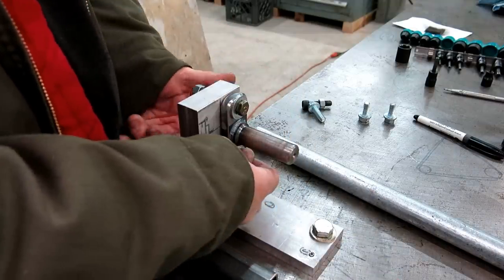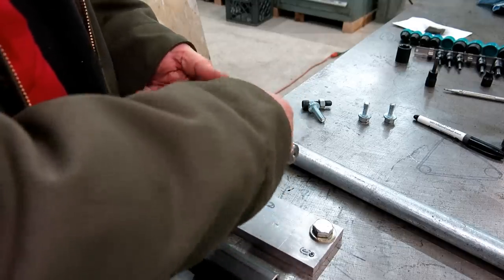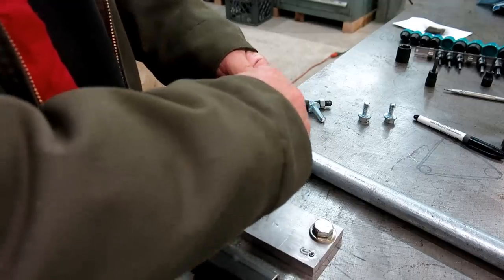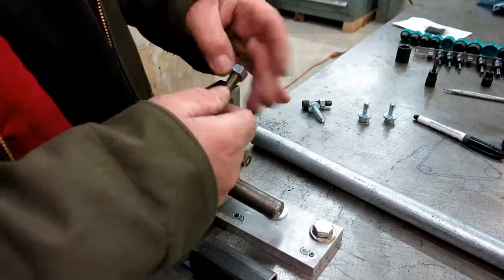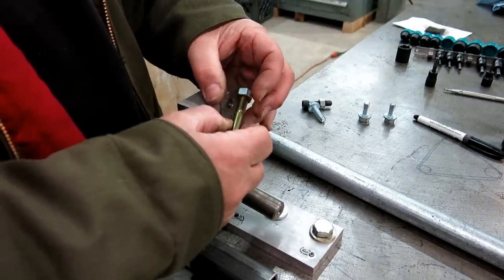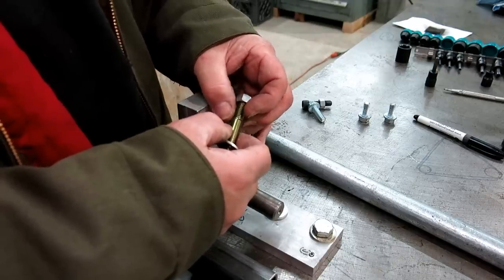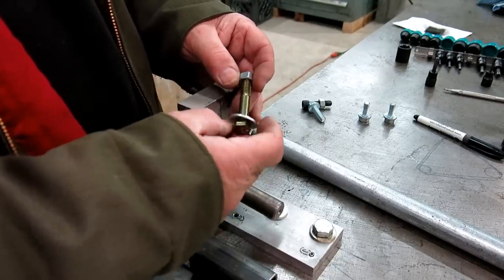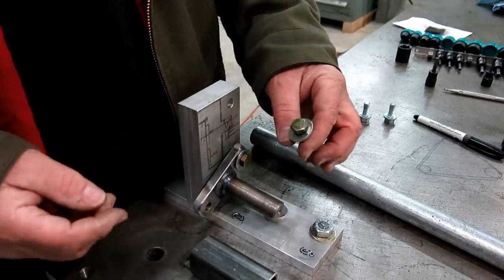So the nuts are behaving themselves. In a bolted connection like this, the way the joint loads up is the nut dilates, basically. It starts to yield and conforms to what's there and spreads that load out. And then ultimately it fails through, you know, the nut dies. So in a connection like that.